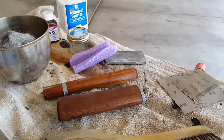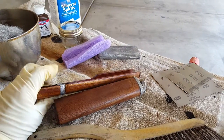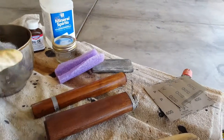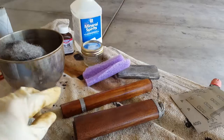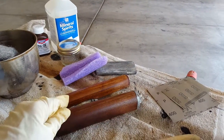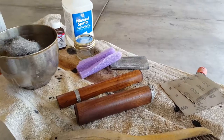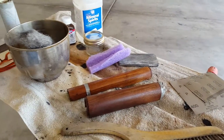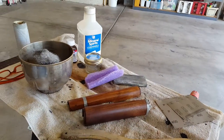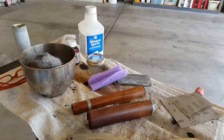I've sanded everything — the stock and the other two pieces — and coated them with the two-to-one mixture. I wiped off the excess with steel wool and I'm going to let this dry for 24 hours. I'm going to do this every day at the same time: come home, get changed, and put on the next coat. I'll show you tomorrow how that turned out. Otherwise, everything's here — nice and easy. Now I'm going to clean up the mess and call it a night. This is Moe — have a good night.